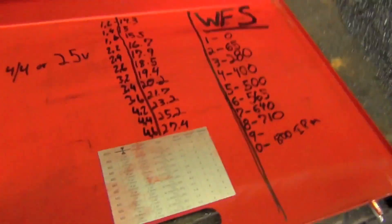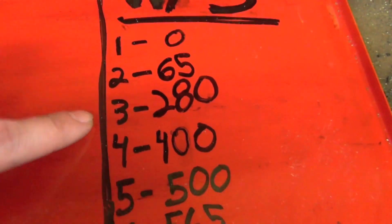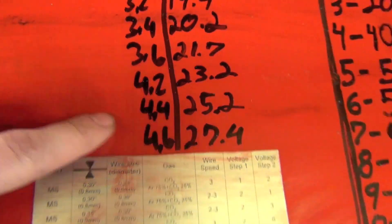Now the last thing we have to do is get our welding parameters dialed into this MIG welder. These are approximate measurements we took earlier. If you're curious how to determine wire feed speed from a welder that has a readout of 0 to 10 or 0 to 100% rather than standard inches per minute, we actually made a video on that — I'll post a link in the description. From our readout, we figured that a wire feed setting of 3 gives us about 280 inches a minute, and since we're aiming for 250, we want to be just shy of 3. We want 25 volts.